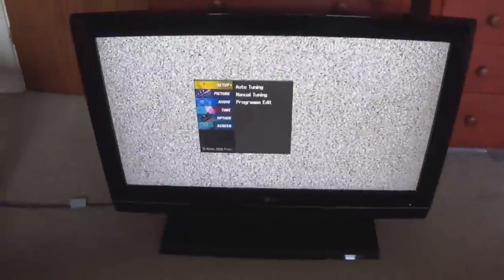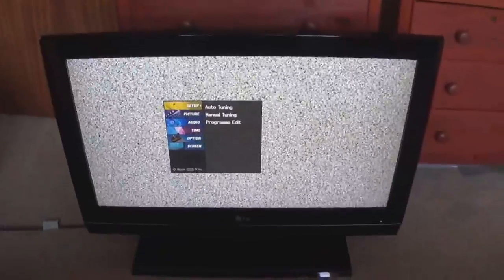And the circuit that they were feeding, the ones that I replaced, is pretty sensitive, really. I mean, the voltage difference on that regulator was only about 0.4 volts. But it was enough to cause the TV to go messed up and goofy.